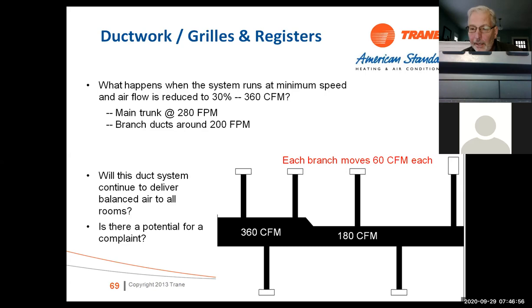If it's a duct system that's down south where it's all in the attic, on the air conditioning, that low CFM is not a big deal because the cold air is going to drop out of the ceiling and it's still going to cool the space very, very well. Where you run into problems in our part of the world is when you've got floor registers and you try to push that cold air up, you get lazy cold air that just lays on the floor.